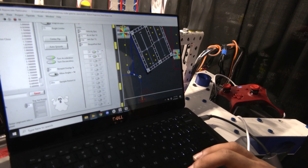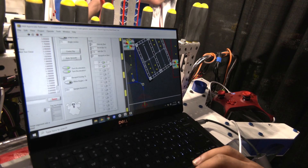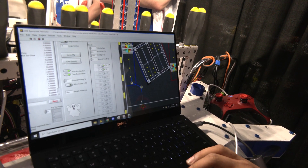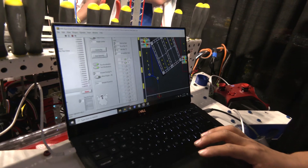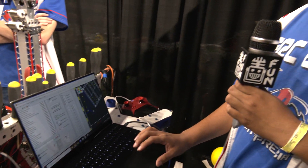We take all of this data and integrate it with our IMU and other sensors to localize us. That's kind of how you compensate for drift a little bit too. We take our velocities and the deltas between our angle for each 20-millisecond time step and integrate that with where our IMU thinks we should be to correct for any drift.